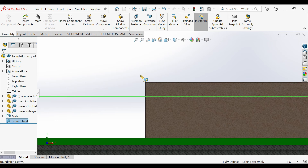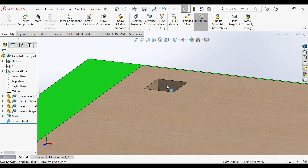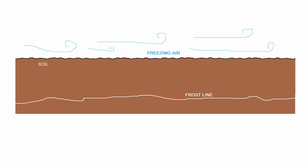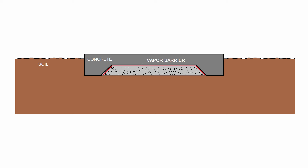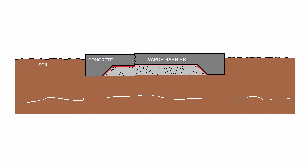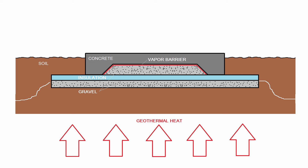Rebar and mesh are critical components which should definitely not be left out. The foundation's top surface sits 4 inches above grade, with the bottom of the concrete being about a foot deep. I also included a small hole for future use — if I decide to add plumbing or a geothermal setup for the loft, I'll be glad I included this. The insulation underneath the foundation may seem strange, but if you live somewhere with cold winters, the ground freezes to a certain depth called the frost line. Slab foundations are pretty shallow, so the ground underneath can freeze and expand unevenly, causing the concrete to crack. Placing insulation underneath traps geothermal heat and raises the frost line directly underneath, preventing this.